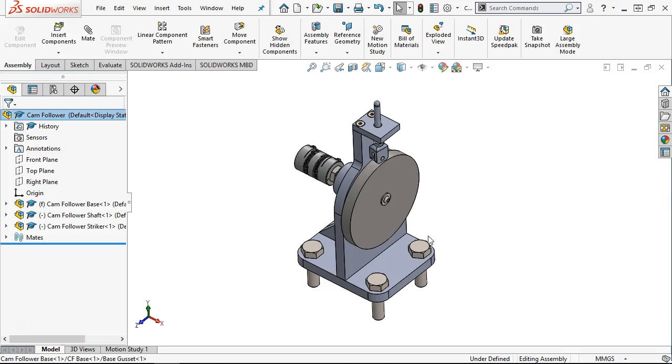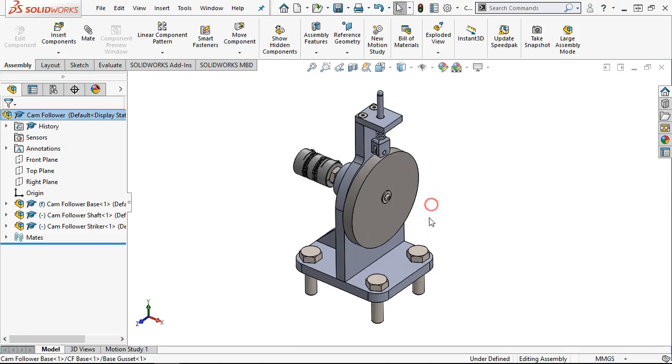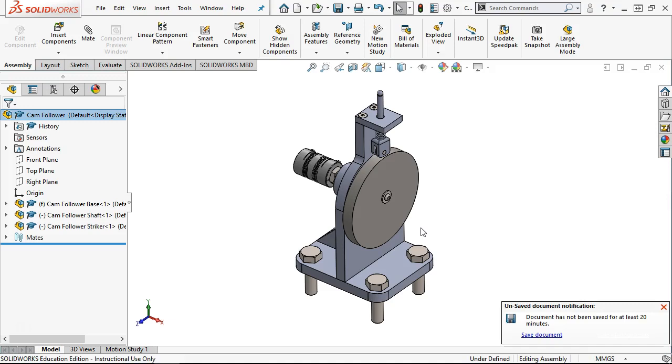And then your task is to apply form tolerance, profile tolerance, positional, the TIRs, the runout and total indicator runout, and basically go through and do the kinds of analysis I'm really interested in, because I haven't ever really applied the fits, the running fits, the clearance fit, the locational fits, the transition fits. It is enough to give you fits.